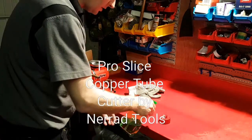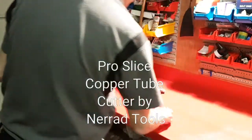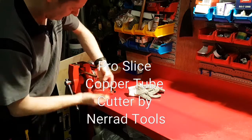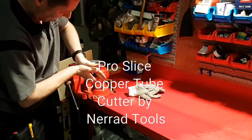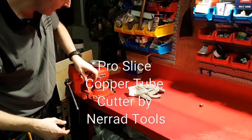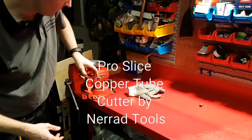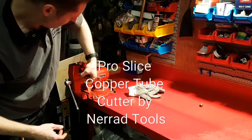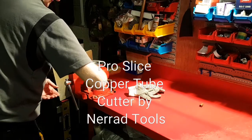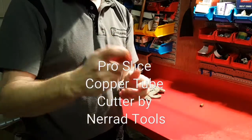So we're going to do the wet test again like we did on the 22. Because we do work with water doing plumbing — let's have a look. This is a little slippier because obviously it's a smaller slice — the surface area to grab hold of is a lot smaller on a 15 than a 22 or 28 — but in terms of cutting through, it's cutting through fairly well. Absolutely wet, still you can grip it really strongly.